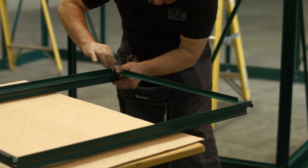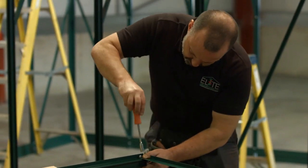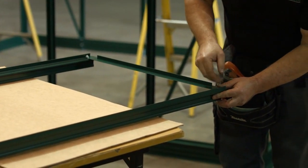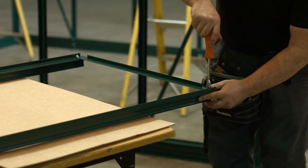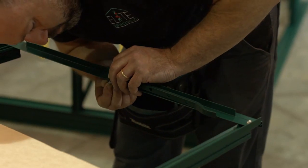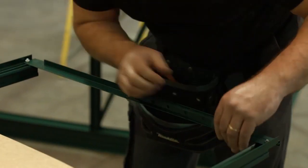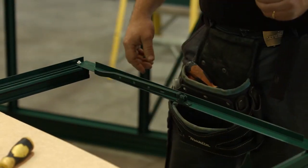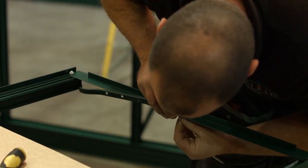Note the correct orientation of the components: bolt channels of the side rails facing up, V grooves of the bottom rail facing up, and the hooked hinge of the top rail facing up. This is being viewed from the inside. Fit the casement stay to the bottom rail using the M4 nuts and bolts. Stays are not needed if an automatic roof vent is fitted. Repeat for the other vents.